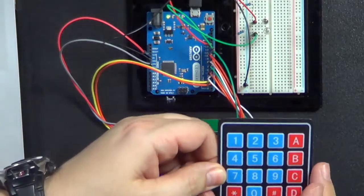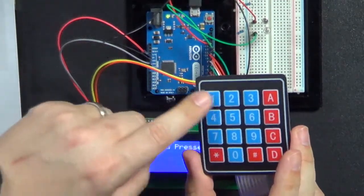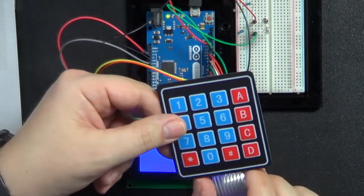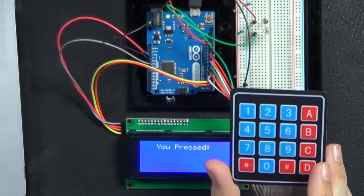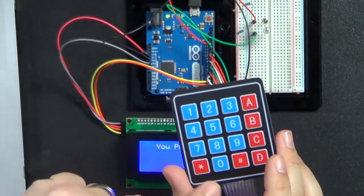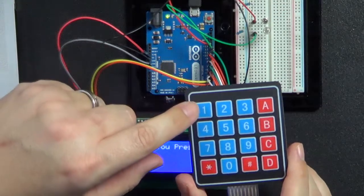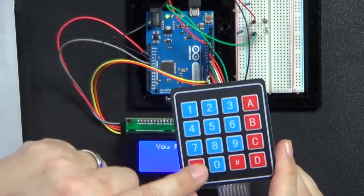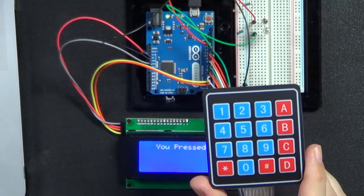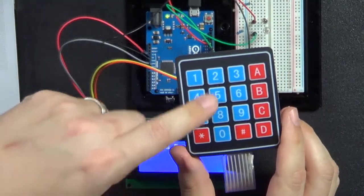The way these work is these little runs that are down here in this cable. Four of them go to these rows, and the other 4 go to these columns. When you press one of these numbers, 2 of these pins get connected together. So what's happening in the Arduino, and I'm going to talk about the library that's doing this a little bit, is it's serially going through 4 of these pins, making them high really fast, around in a circle. I don't know if it's doing it by row or by column, but it's basically saying this row is hot, or has a high, high, high, and high. And when you press this, the high goes back down the other side, and it looks for that. So it's basically scanning, looking for what's been pressed. So that's the 8 pins, 4 for each row, and 4 for each column.